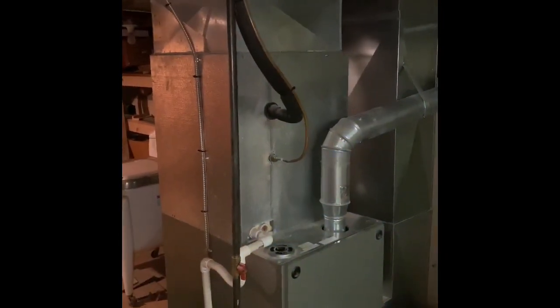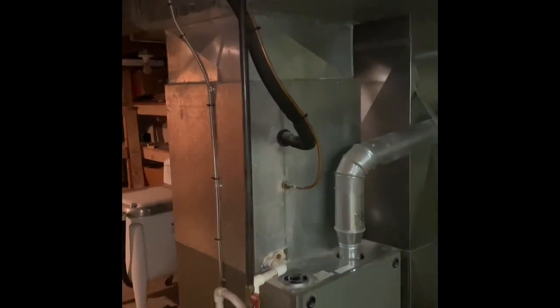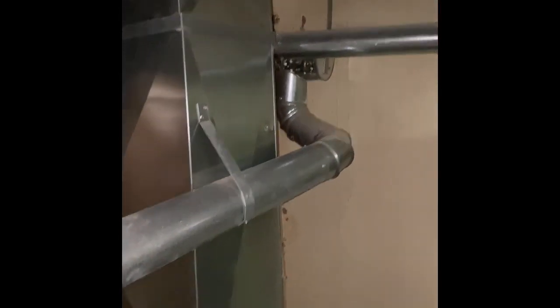The coil is going to have to get lifted up, so we'll move our coil up. We'll do a new supply plenum. The four-inch flue pipe will get rebuilt, so just bring some four-inch. We'll come right off of that tee back down into the furnace.